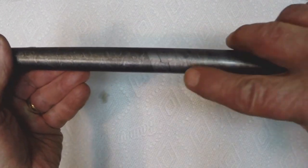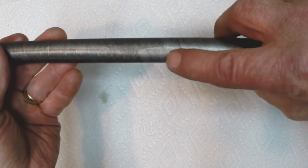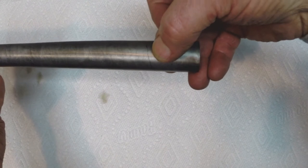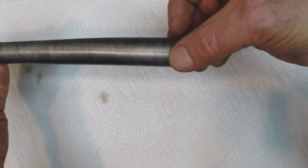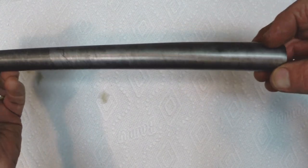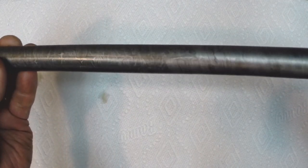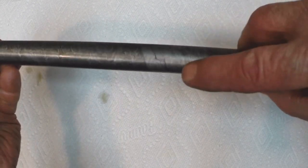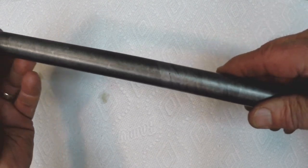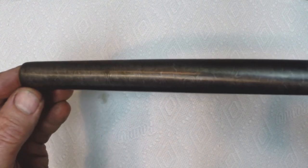And interestingly, where it blew the welds, down here in the middle, is where these two rods were scarf welded together. And then, of course, where the original broken weld was that I healed up really good, that's down there in that oddball material as well. I don't know what that indicates. Maybe this was a practice tube by an apprentice blacksmith. But it is an oddball piece, and it's interesting that these welds come apart where those two were scarf welded together, whatever that means. But this part down here has got a very nice pattern to it, and I hope you can see that in this video.